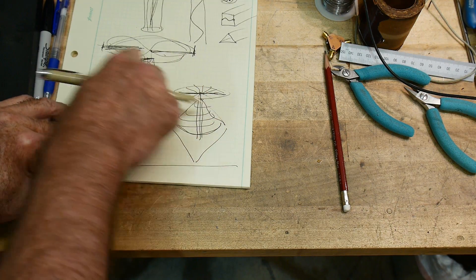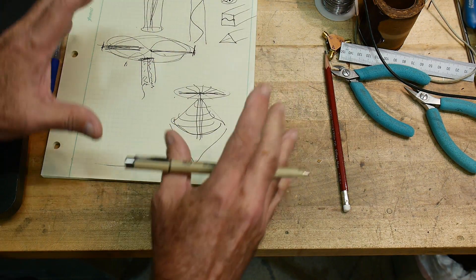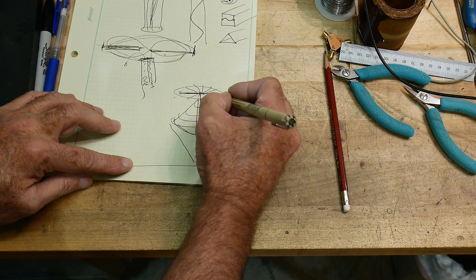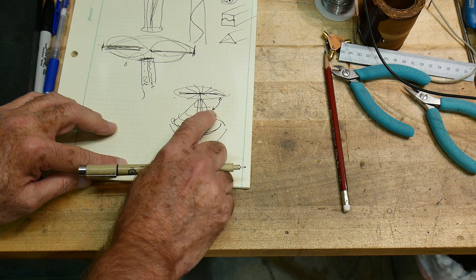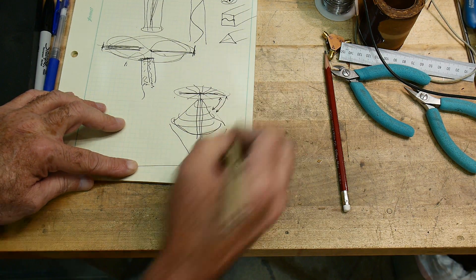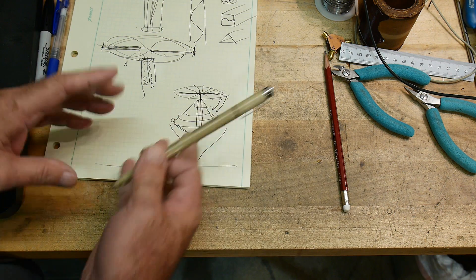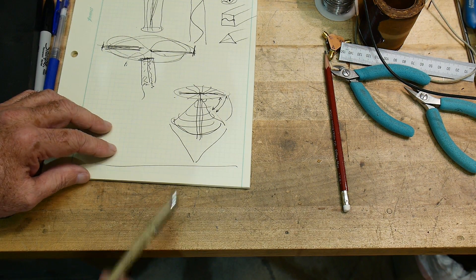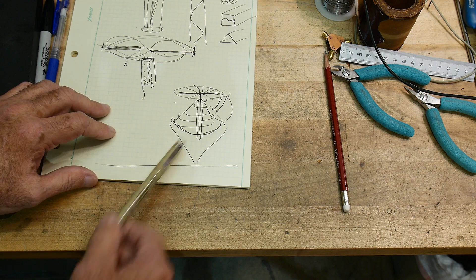Why mention these? Because of this place for the E&M wave to go. When the E&M wave comes out, it sees this wonderful area and says, 'I'm this big, so I find my own little spot to resonate right here.' If it were longer it might be happy further out. Disc-cone antennas work at a huge wavelength range — the widest band antenna around. Real short wavelengths fit at one end, real long wavelengths fit at the other. I always wanted to build a big one for 20 meters — it would fill up your backyard.